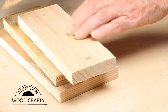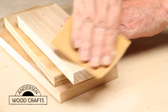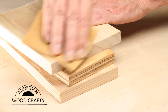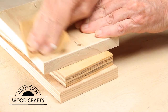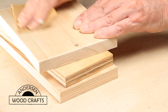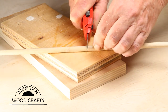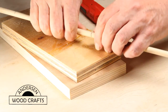I'm going to sand everything now before I put the posts in — including the paper towel holder — to 220-grit sandpaper. And any of the exposed edges, I am going to round over the edges quite well. Here's what I was saying about how I cut the other dowel, because it was a smaller dowel: just use a straight edge, score the dowel, and then snap it.